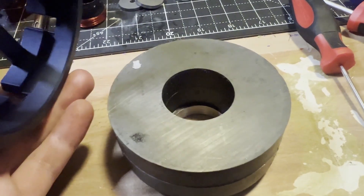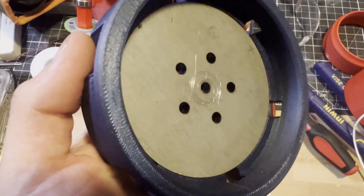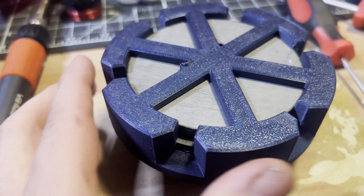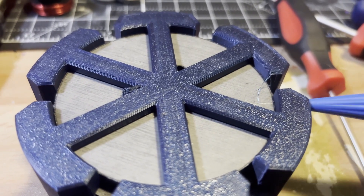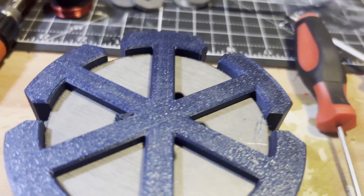The bottom printed piece was not strong enough to retain the bottom plate in place, as it would flex enough to let the bottom pole tilt sideways. The remedy was to fix the bottom plate in place using a much stouter 3D printed aligner — it would align the plate and magnets around the same axis, and then allow me to use a lightweight CA glue to fix the plate in place and then remove the aligner.